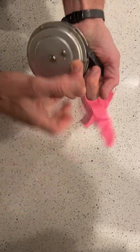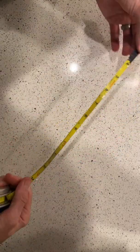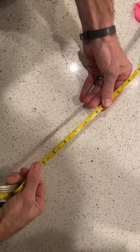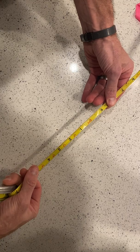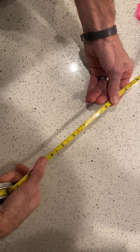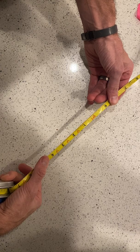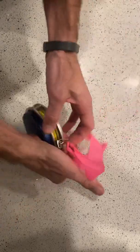On the other side of the tape it is broken into English inches, and this tape is in tenths of a foot. Most likely you're going to be stepping out 66 or 100 feet. 66 feet you can get in one pull; 100 feet you're going to have to do in two separate pulls. That's where you're going to use your pacing as well in order to measure tree heights. Any questions? Hit me up this week.